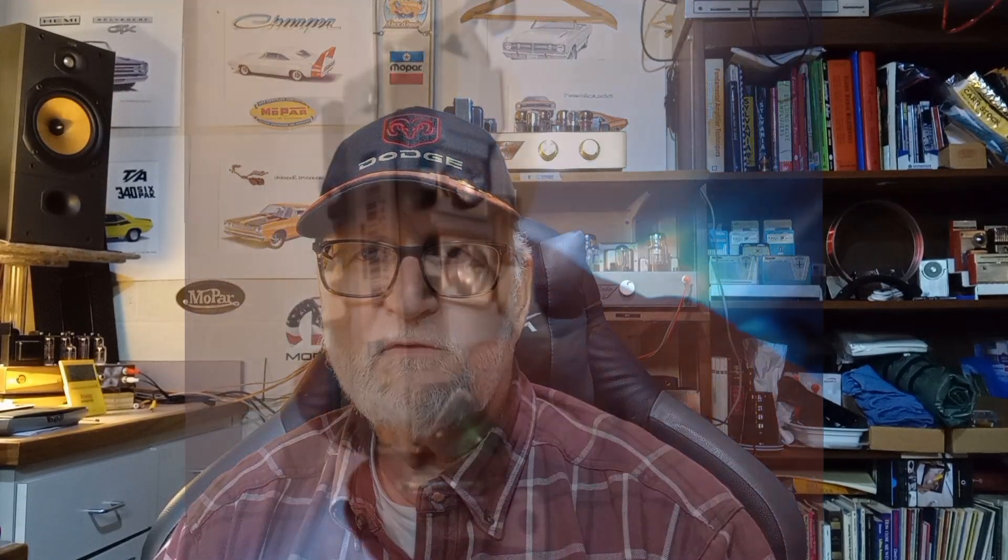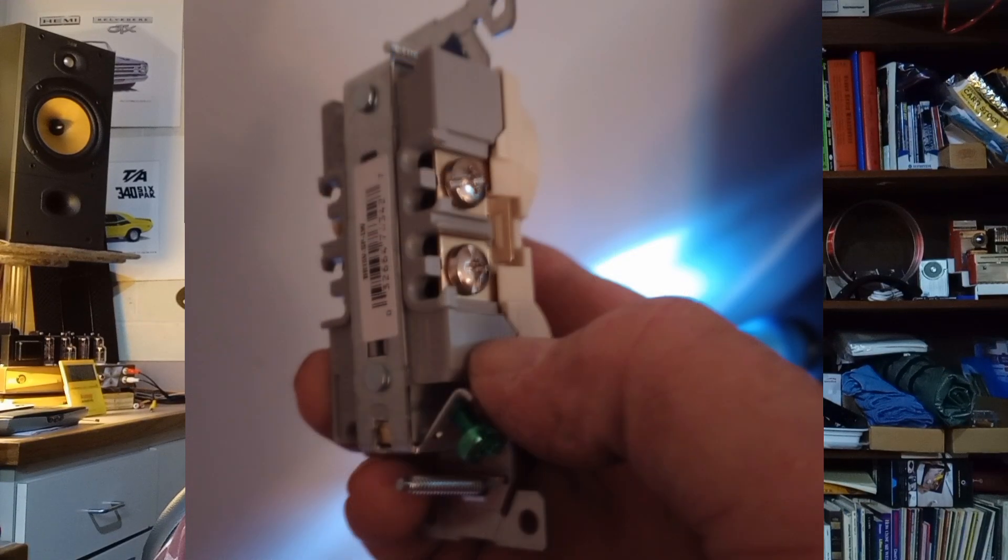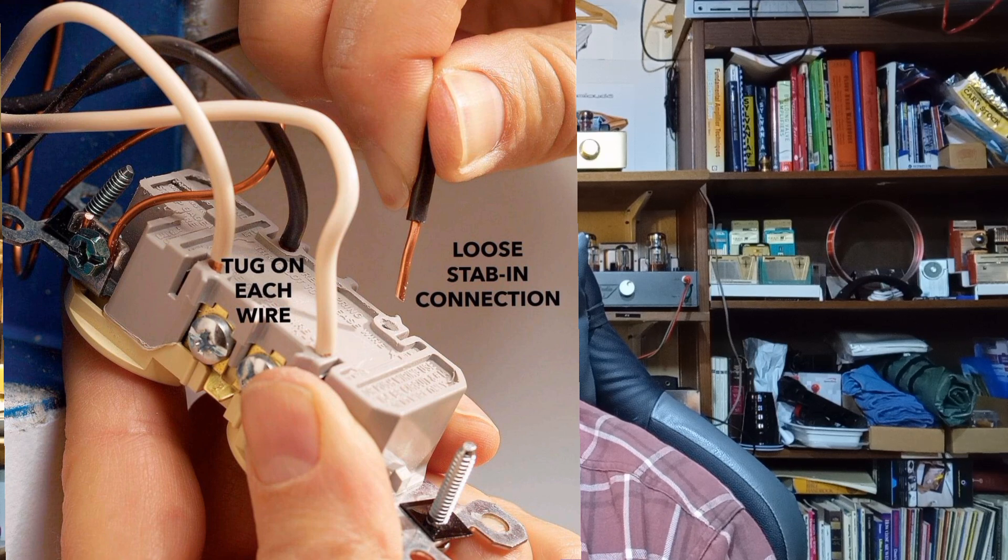These were cheap receptacles. If you're going to replace receptacles, stay away from those 79-cent pieces of junk. I replaced a lot of receptacles in the hospital — we used hospital grade there, and in other areas we used spec grade. Here's what I used to replace these two receptacles: a nice solid one with a ground strap completely across, and back-wire clamp screws, which hold the wire far better than wrapping around screws. A lot of outlets are designed that way now. The old push-in back connections were also junk — not a good connection.